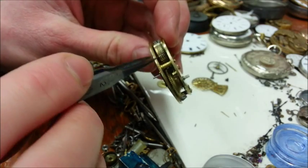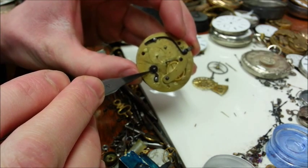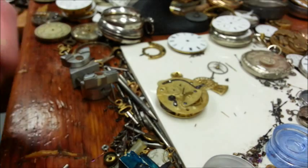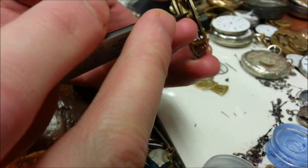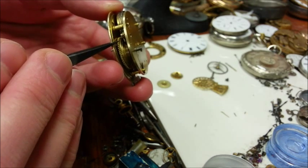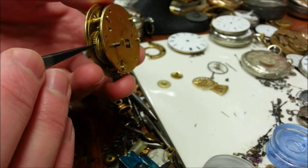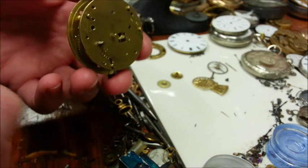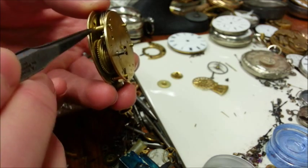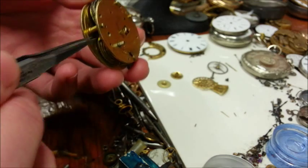The purpose of the chain is so that the mainspring is never fully unwound and never overwound. If you turn the ratchet too many times, you'll put too much winding in the mainspring, and when you wind up the watch you can end up breaking the fusee chain. There's a stop on the fusee cone right here — this little piece is part of it — that prevents you from ever overwinding the mainspring. If you put too much pressure in the barrel, you'll shorten the mainspring too much, and the chain will snap under too much pressure. If it's a proper length of chain, it should go all the way up the fusee cone, hit the stop, and the mainspring should still have energy and room to spare. Just watch that and make sure the stop works properly.